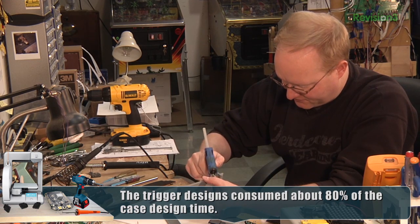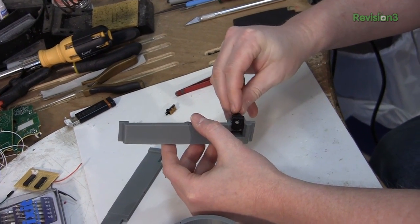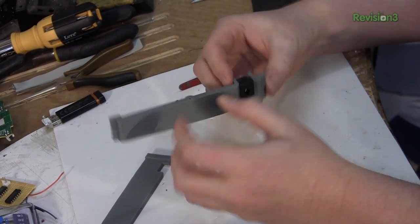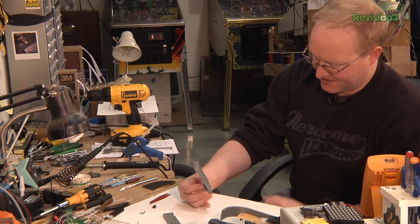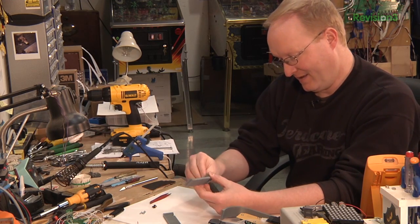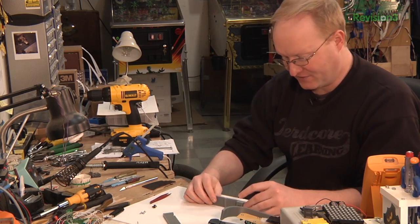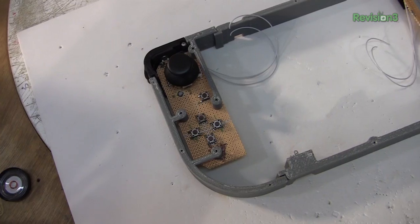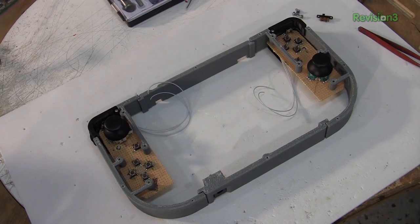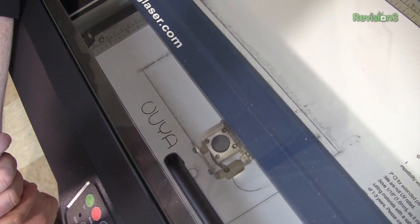While those parts dry, I'm going to start on the charge plug. I made this case as four different pieces, basically so it would print more reliably. Instead of spending five hours printing the whole thing, I spent about two hours printing each piece — so if any one part fails, you don't waste as much time. This is kind of how it'll go together, and I made these little lips so you can see how it interlocks. For the front and the back, I'm going to use laser cut pieces of plastic because it'll give a much better finish than 3D printing will.